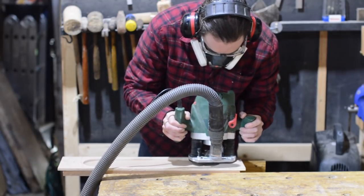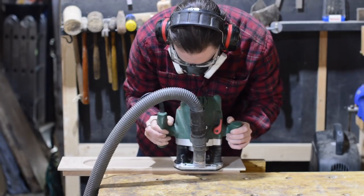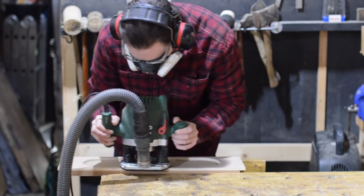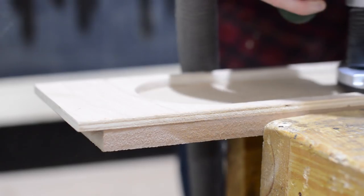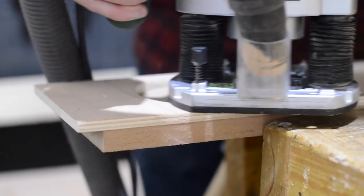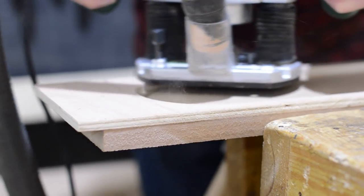This will make the cut nice and repeatable, but it will make the cut slightly smaller than the template so you've got to take that into consideration when you make it. My only criteria really is that I could get my hand through the hole and my drill through the hole. I plunged about halfway and made a first pass, and then plunged all the way to make the second pass.